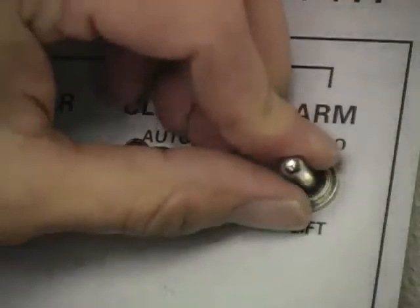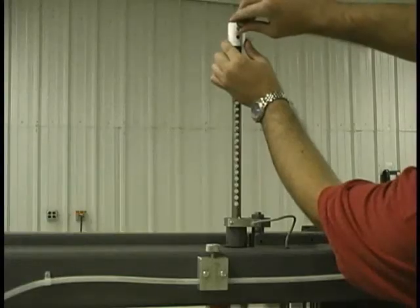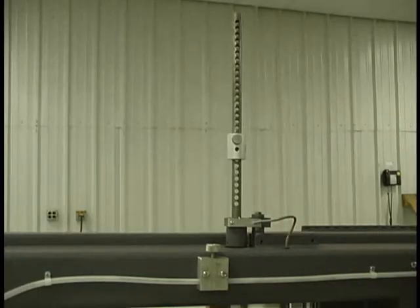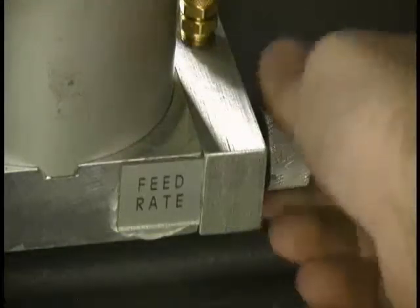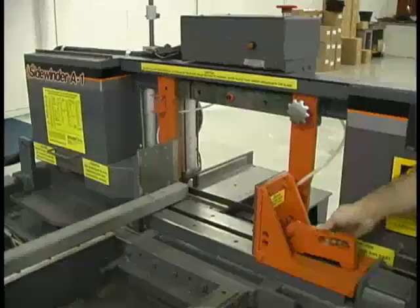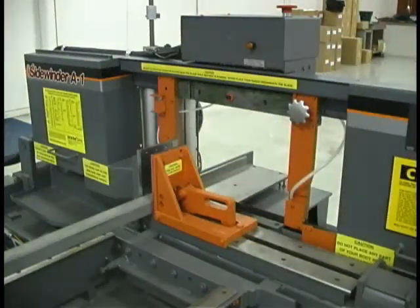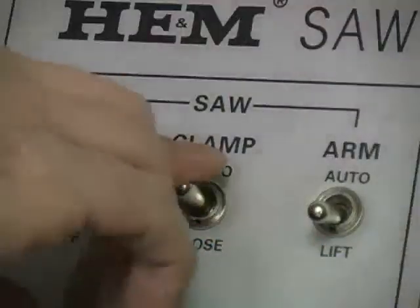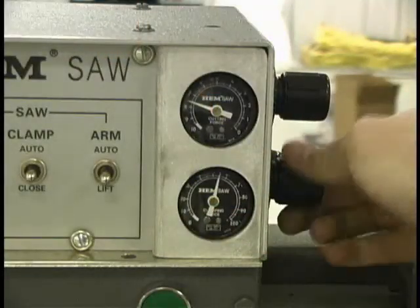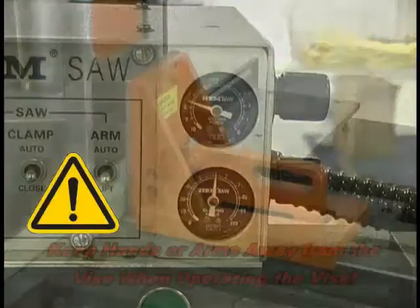To make a manual cut, lift the arm by moving the arm switch down to the lift position. Adjust the arm height with the upper arm stop to have it close enough to the material so that the arm does not have too much free fall before starting the cut. The feed rate and cutting pressure should also be correctly set for the material to be cut. Place the material in the vise, making sure it is laying flat on the vise ways and in the cutting area. Move the clamp downwards to the closed position. Always check the vise pressure to determine that it is sufficient to hold the part but not high enough to deform smaller sections or thinner walled material.